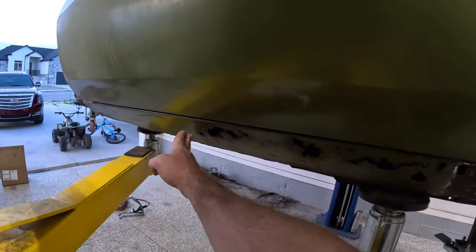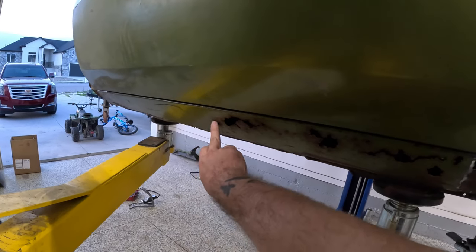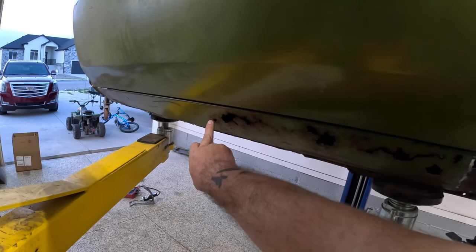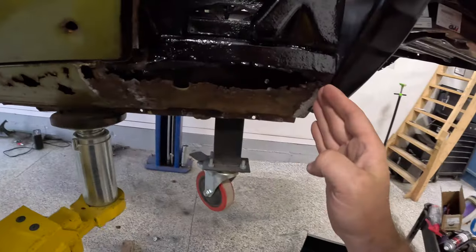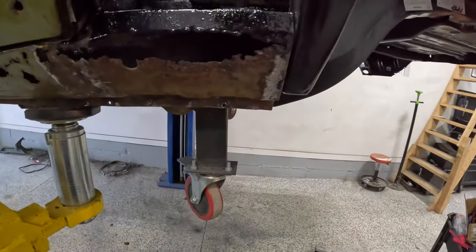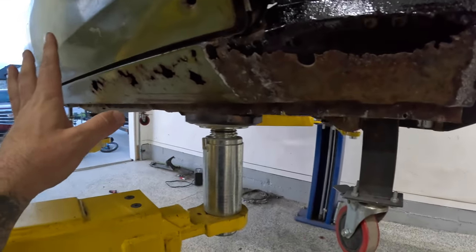So what I'm gonna do, I ended up measuring about 2 inches or so in front of the worst spot, because you gotta figure there's probably some more rot that's just outside of this first hole right here. But measured from there all the way to the backside right here, and what we're gonna do is just cut off basically what we need to make it fit.